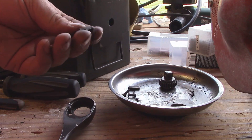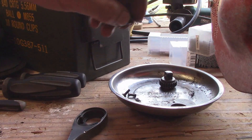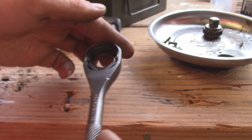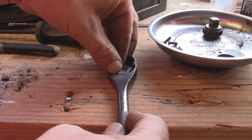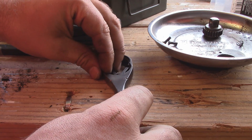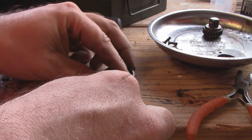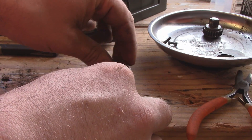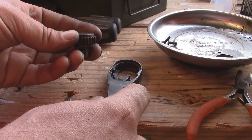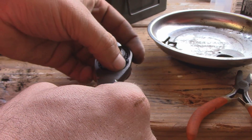Keep in mind you're working with tiny small parts, which can be pretty irritating. But you just want to stick both of the pawls back in exactly like this, with the notch corners facing down. We're going to have to very carefully put the springs in. So I just moved the little lever the other way — this will give us clearance to stick this other spring in. And then stick our cog back in. And it actions as it should.